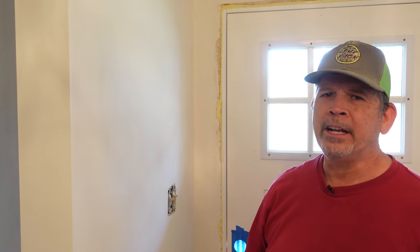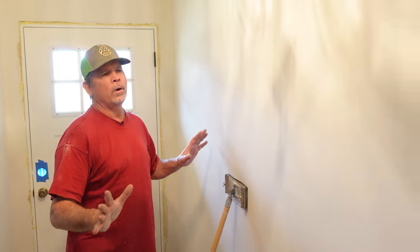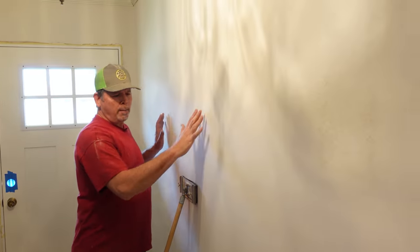We've got the ceiling primed where I made that big patch. Now we're going to prime the walls. We left the walls smooth — I didn't spray texture on them. We liked the way that looks, kept the foyer smooth so it's a little more elegant, and that wall is going to get some wallpaper. But somebody — their name is Paul — got overspray on the wall when texturing. So I'm going to use my sanding stick for drywall, one quick pass, knock it off, and it's ready for primer.